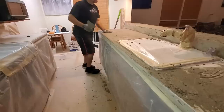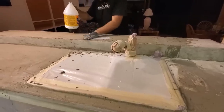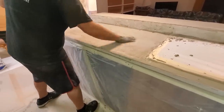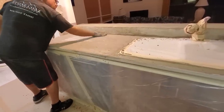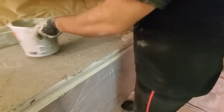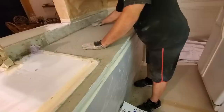I started at one end of this kitchen and did the entire project consecutively. I bounced back and forth from where I started to the new sections so that I could get the timing right, and adding more concrete bonding adhesive helped me smooth those counters to the desired texture. This was key. I liked that peanut butter thickness. It got some really fun texture, and I came back and smoothed it out as it started to set up.